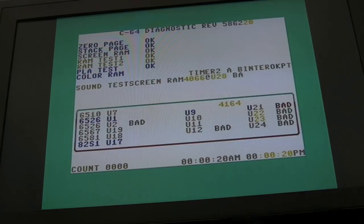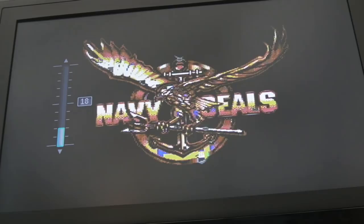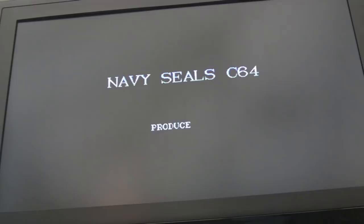Let's just try a game cartridge. I've got Navy Seals in here - let's switch that on and see what that does. Yeah, some graphical corruptions there, sprites out of place, sprites missing. Sounds okay. That would suggest the CPU is okay. Now bear in mind this is a cartridge so it might not be utilizing all of the RAM - it depends on which areas of the RAM are affected. I think if it was a RAM fault, I'm more inclined to think it's actually a PLA fault.